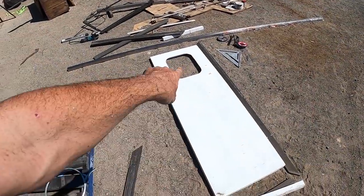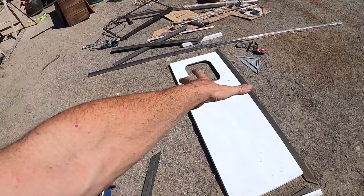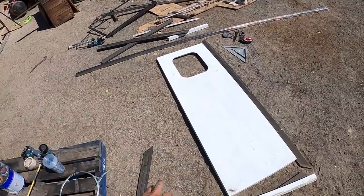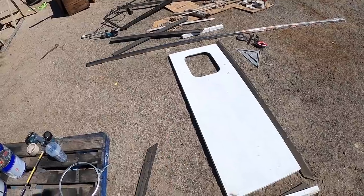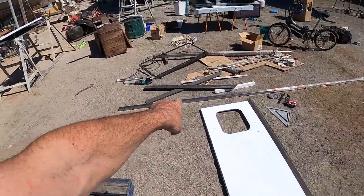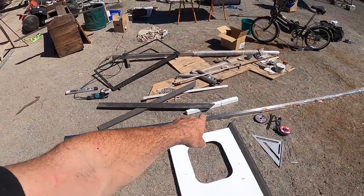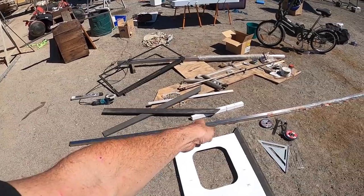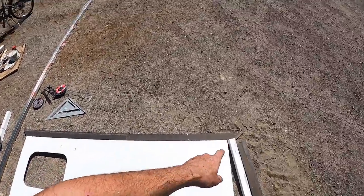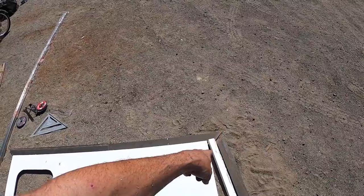This is the door from the side of the wheelhouse and it's actually a slight parallelogram — only about three degrees out of square, but it's pretty critical for it to close and seal up properly. I am making the new frame out of stainless steel. So let's cut this, say, 43 and a half degrees to give us a bevel that gives us 87 degrees, and then the other end we need a bevel that gives us 93.